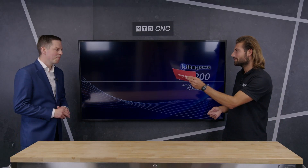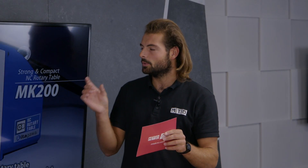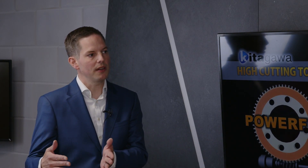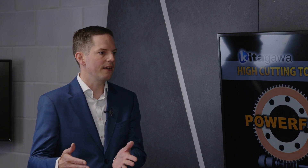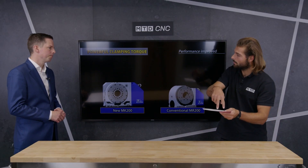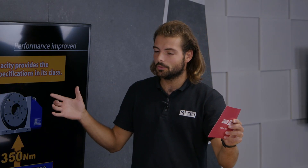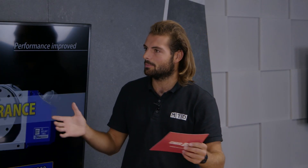The tail spindle has been made as thin as possible, and the table is obviously as thin as possible by eliminating the face plate, so you're bolting the fixture straight onto the rotary directly. The combination of top-to-bottom bolting and no face plate maximizes your working area and also makes trunnion design more straightforward.